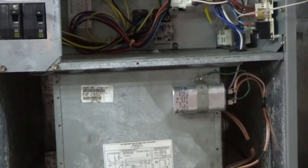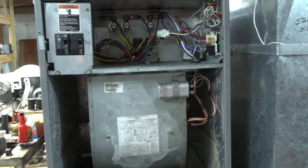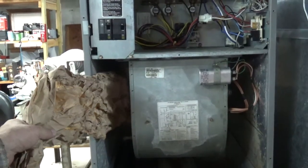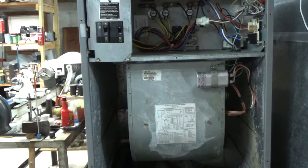One last thing before I put the panel on: I'll turn everything on and make sure I feel suction here, drawing air on this side. It's going to be blowing up into the air handling unit so I could go upstairs and feel a vent — but as long as it's drawing here, I know it's exhausting there. They don't come on right away — even if there's a demand it's going to take a little while for everything to check, then you'll hear the thermostat click and then the fan motor may come on. It passed the smoke test. Here it is drawing in on my left, and I checked the vent to make sure it's blowing out. Fan motor and squirrel cage changeout complete — we are back in business. Thank you for watching.